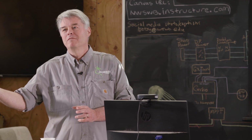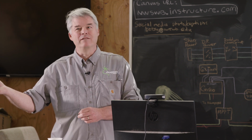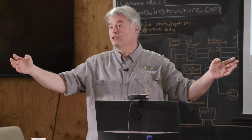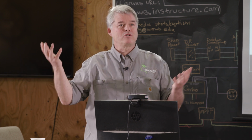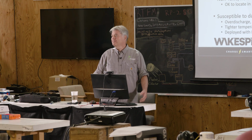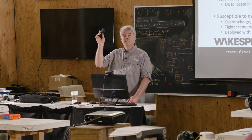Well, people are smart but slow, engineers. We figured out that the problem was that we were shipping these batteries out at 100% state of charge and they sat on the shelf in storage for 6 or 8 months, and that was harmful to the battery. So what was our solution? Ship the battery at 40% state of charge. And that is why today, whenever you get a battery, whatever it is, the first thing they tell you is to fully charge your device before using.